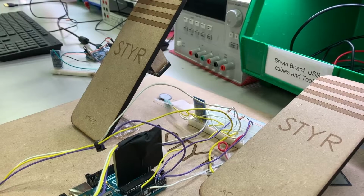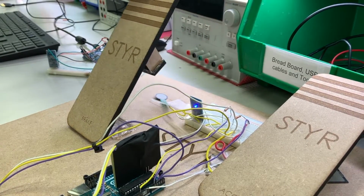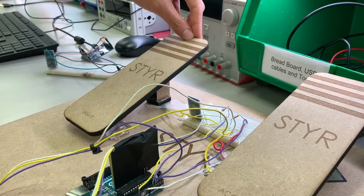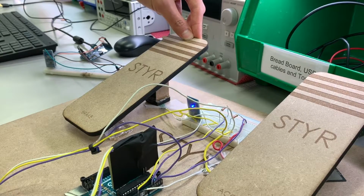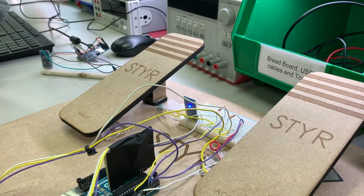We first wanted to set up the pedals with a push spring and have the full effect of a pedal going up and down, but due to the lack of springs available to us, we had to create a firm stand for the pedal to be placed upon. The pedals were also placed on a hinge originally to properly work with the spring system, but after we removed the springs, the hinges allowed us to work better on the pressure sensors below the pedals.